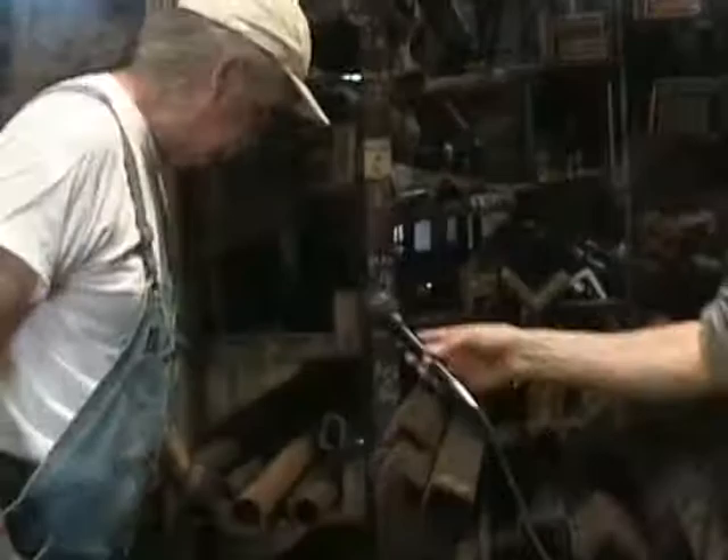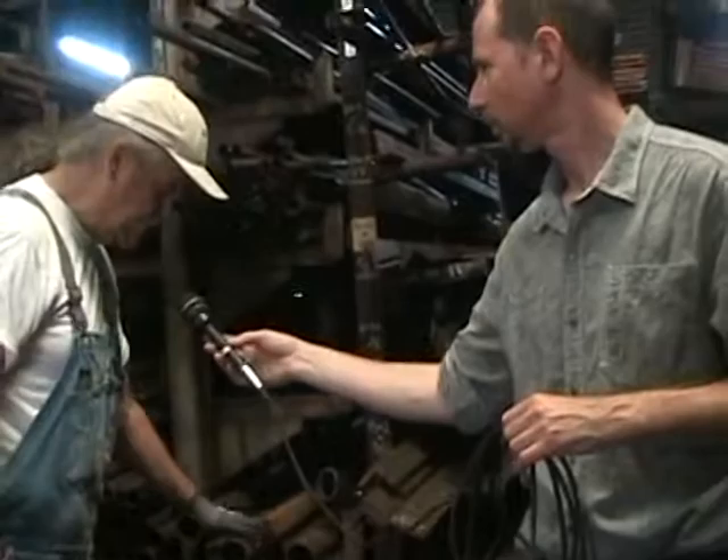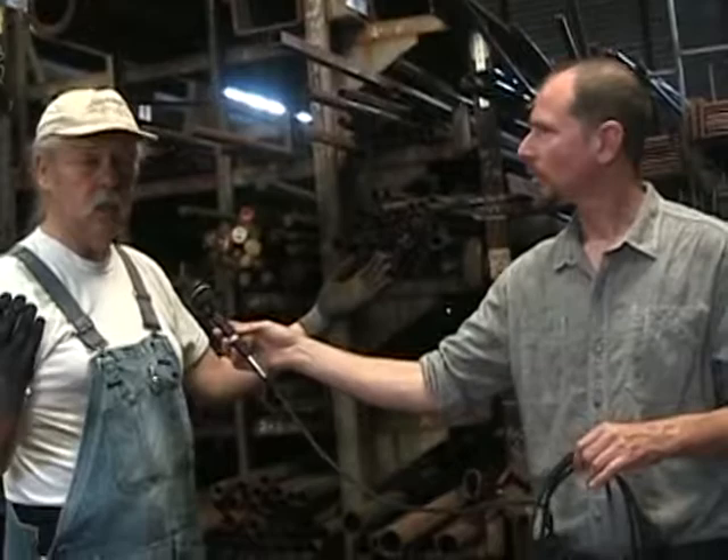I started off with a piece of tube for my main support. With these other eighth-inch pieces, I've welded them across this way, and my panels mount on that. This is mounted on a pole which rotates, and that tracks the sun. I have a circuit board that follows that. I used an old dish mover — one of those big 10-footers that people give away all the time. That was my actuator. It moves the tracker back and forth. It's 12-volt. I ran it on a little battery with a trickle charger. Never had a problem — it's been on for two years.